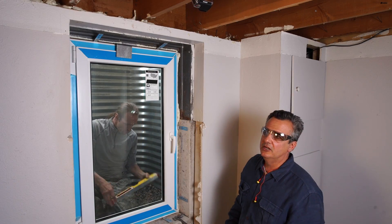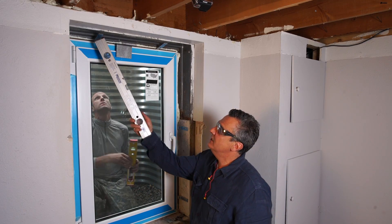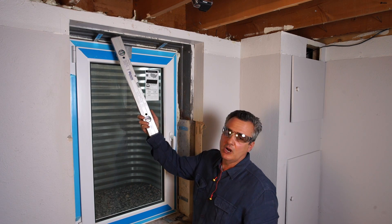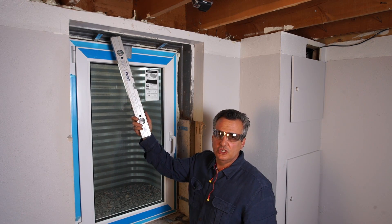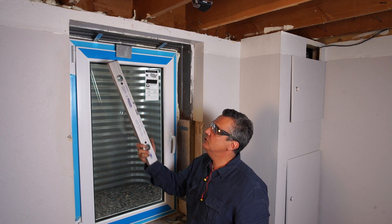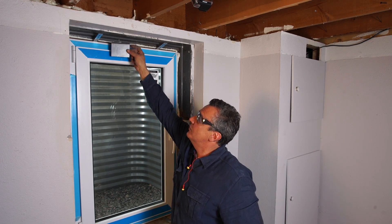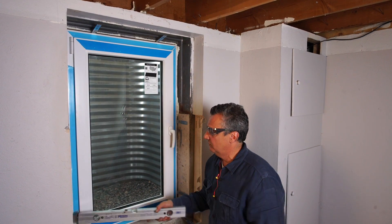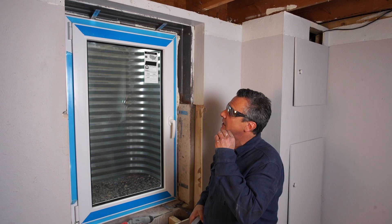We're really close to being done. The only remaining thing is to fasten the last two straps with the appropriate fastener: a wood screw for wood, a self-tapping screw for sheet metal like this, or a lead head for concrete. We remove the little stabilizing tool, set it aside, add a little foam, and we're done.